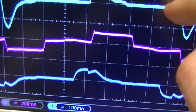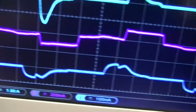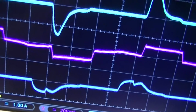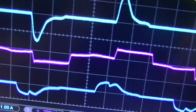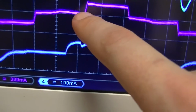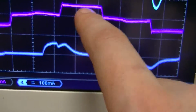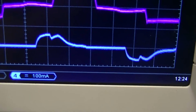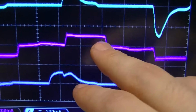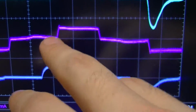This fluorescent lamp, as I've already mentioned, is, I think, an 8 or 9 watt Fiat Electric Taiwanese made lamp. You can see there's just a little bit of a change in operating current in the area around zero cross, and then at about the 80 to 100 volt mark, the driver turns on and draws relatively constant current despite the mains waveform.